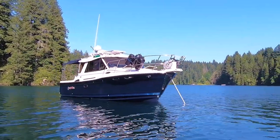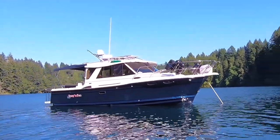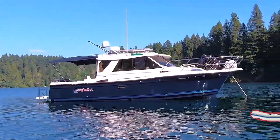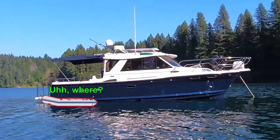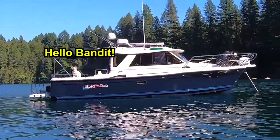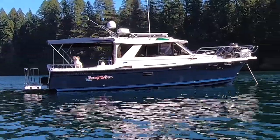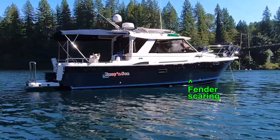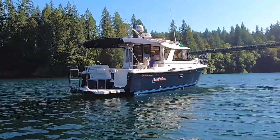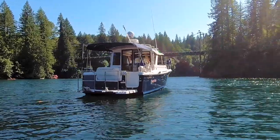At the time of this video, Cutwater has six different hull colors to choose from. Our color is midnight blue, which is a deep rich color that accentuates reflections of water ripples and even objects on the water surface. Note our dinghy reflection as we make a pass around the hull. This deep rich color is beautiful, but there are trade-offs when choosing a dark hull color as opposed to a light hull color. A dark hull color like ours is prone to showing fender scarring from rubbing, which can be addressed with a good waxing and buff in the more notable areas. A dark hull will also show more scratches with normal use.